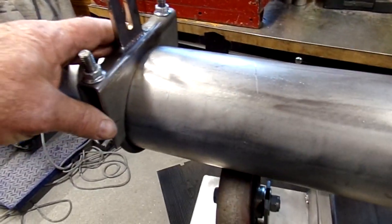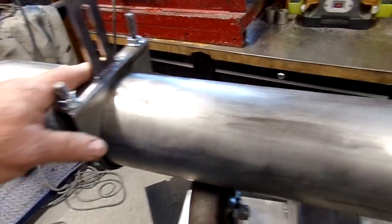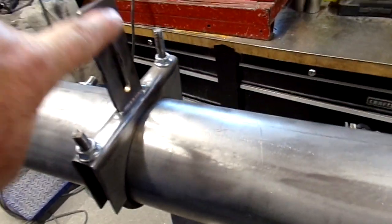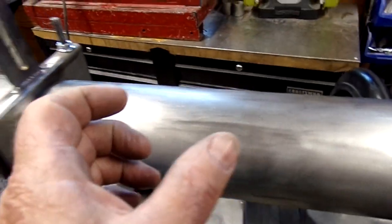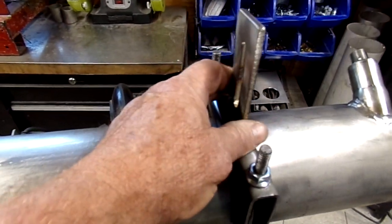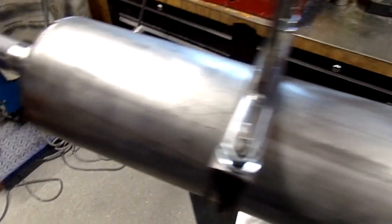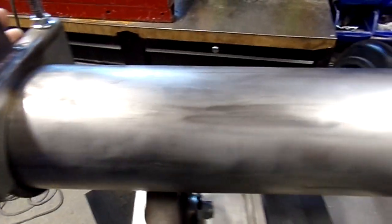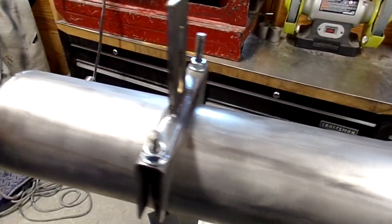There was a question as to fitment, because he doesn't have his machine here, so I decided to put in these 4.5-inch U pipe clamps, and that way you can loosen them up and move them to whatever direction you want. Notice this is slotted, so you can adjust the height as well as the back and forth, so that this can give you a true fit on those TIG welded tabs that are on the frame to support this whole structure. That takes out the second guessing and allows you to get a perfect retrofit on his old frame. So that's what I did.